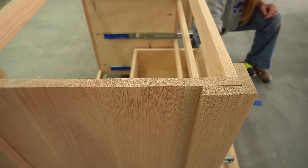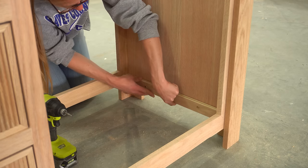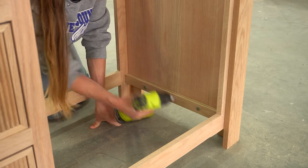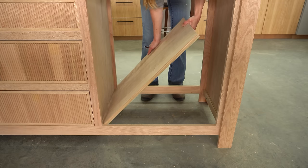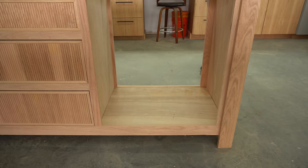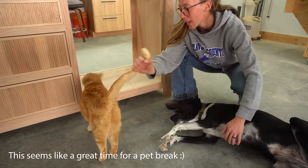Now that the drawers were finished I moved on to the door section. I always like to have a removable bottom in a bathroom vanity — when it's time to clean the p-trap it's nice to pop it out for more room and to keep it clean. So I added a scrap wood support block to the side panel and cut a piece of 3/4 inch plywood to rest across it and the bottom divider piece. If you want to secure it, you can screw it to the supports or install with pocket holes and screws from the bottom.